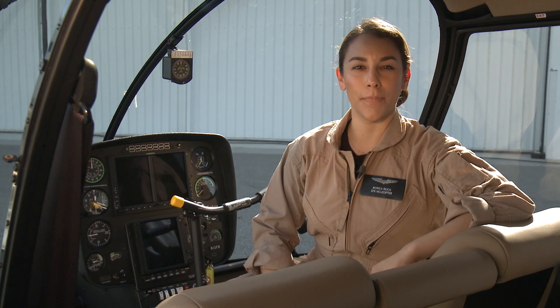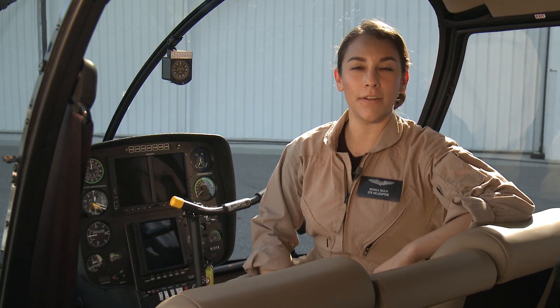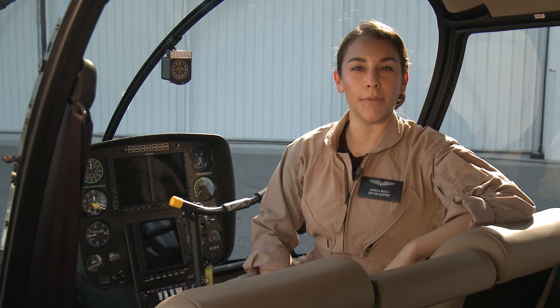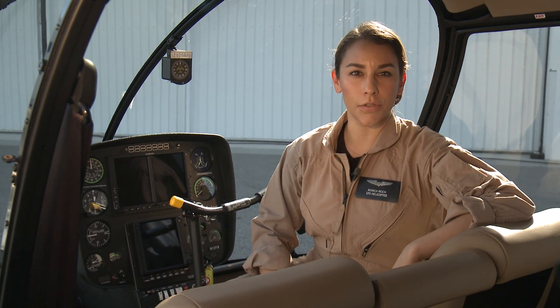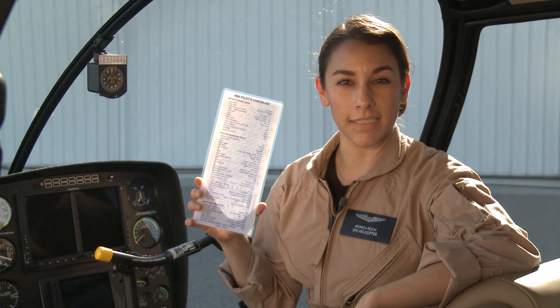Hi, I'm Monica Campos from the Robinson Helicopter Company Flight Safety Department, and today I'm here to talk to you about avoiding hot starts. Exceeding temperature limits during a turbine start, a hot start can cause severe engine damage requiring expensive repairs. Do not attempt to start when rushed or distracted, pay close attention to engine instruments during a start, and always follow the starting engine checklist.